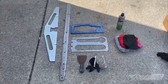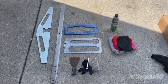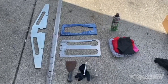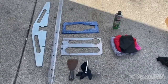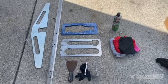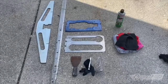The tools needed to inspect a fifth wheel plate and pin are pretty simple. You need a good straight edge — we also have one with a cutout for the kingpin, but any straight edge will do. We have two different style pin checkers; one is made from steel, which is a little more rigid, and that's the one we'll use for our demonstration. There's also a blue plastic one that does the exact same thing. These are go or no-go gauges, meaning they don't tell you in micrometer inches what your pin is — they just tell you if it's safe or unsafe. We also have rags, brake clean, safety glasses, a flashlight, and an old scraper.